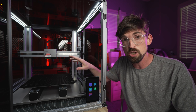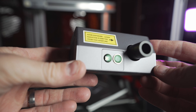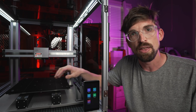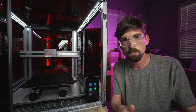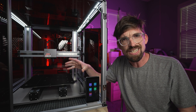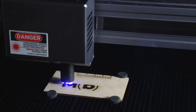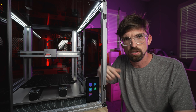This module has two features that pretty much no other diode machine currently offers out of the box. First is an integrated camera, which serves multiple functions. It uses the camera for autofocus — going through a ruler autofocus process to figure out which line is the smallest and determine the correct Z height. It can also take several pictures of your workpiece and overlay them in their software, so you can see exactly where you're going to engrave or cut on your actual material — something you'd normally only see on machines like the Glowforge or Full Spectrum Muse.